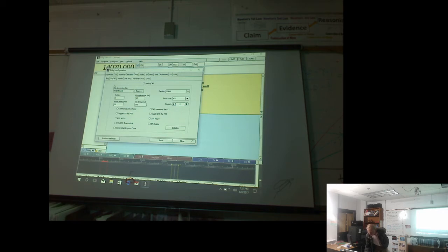In order to do this, what I actually did was write an XML file. It looks a little bit like an HTML file with a bunch of tags and some text on it. FL-Digi has set up a system where you can actually control any receiver or any transceiver using this mechanism. Basically what they're doing is allowing you to select the frequency, the mode, which in this case I only have two, the bandwidth for the unit. In this case, I only have one bandwidth. It's about 1,200 hertz. And also to operate the push to talk.